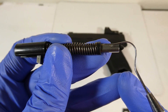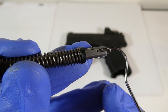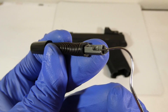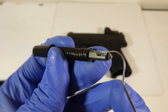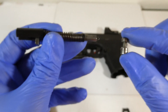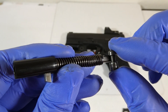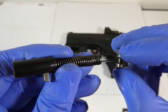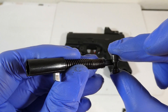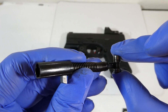You can see right here there is a shiny bevel spot right there — that shouldn't be there. I have another Dagger and it looks completely normal still, and that one has hundreds of rounds. But that shiny spot is a bevel, and that was created by the safety plunger not moving out of the way 100%. It normally goes here, blocks the striker, and then the trigger bar is supposed to move it up all the way out of the way so it just slides like that.